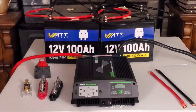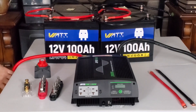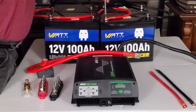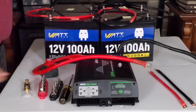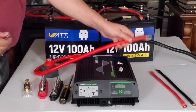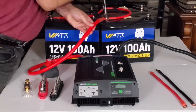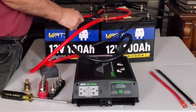We're going to hook up the 2/0 cable to the battery bank at this time. Just like before when I did my capacity test with just one battery, when I hook up the battery bank to the inverter there will be a spark — that is to be expected because I don't have the proper resistor to allow proper connections without causing the spark. It helps to have the longer screws in order to connect multiple cables. And as I said, there will be a spark — that's to be expected.